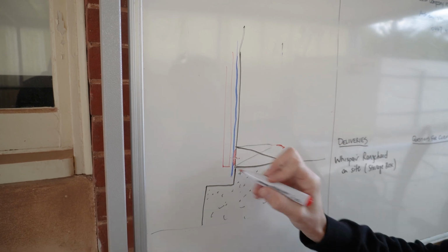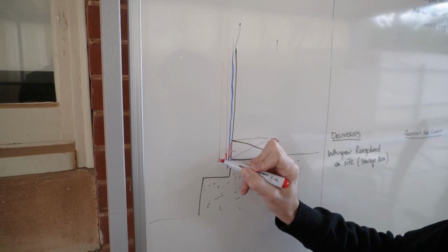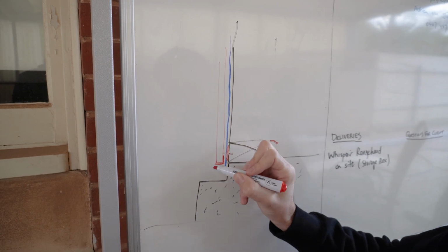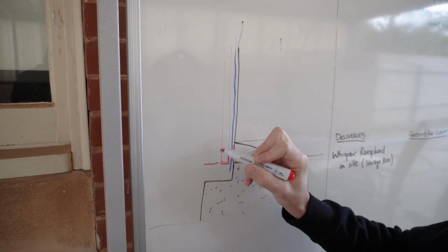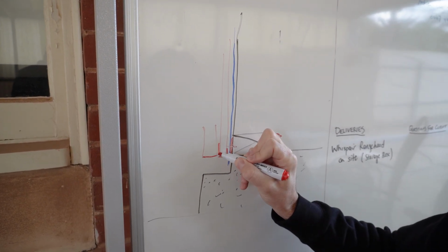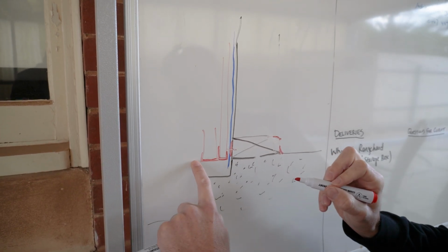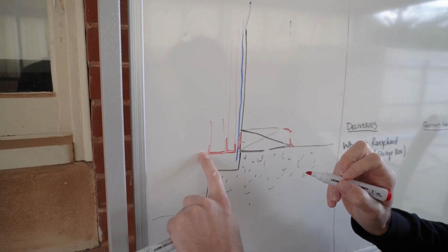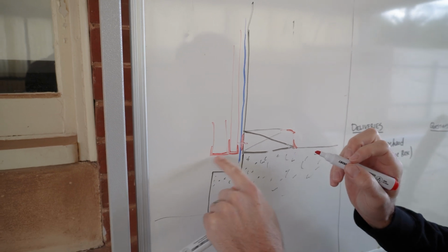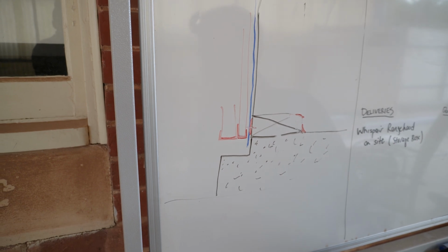What we've got going on the bottom then as well, underneath our cavity batten, we've got a little metal angle that's got a perforated bottom on it to cap off the gap onto the bottom there to stop vermin and bugs getting in. On the outside of that then, we've got our 50mm Basalt rock cladding that will go on. That's got a starter strip that gets nailed to the face of the cavity batten with a perforated edge on the front, to be able to get rendered, and then that'll cap off all of this to be able to make sure that it's all nice and weather tight. Now we've got airflow going up our wall cavity there, and making sure we're keeping it airtight and nice and dry as well.